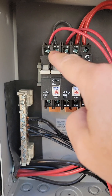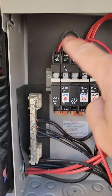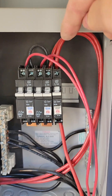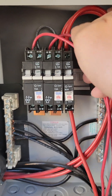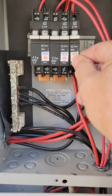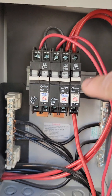I've had situations where these screws were loose and only half the solar panels were working. I've also had it where the screw feeding onto the main line was loose. As you wiggle the cables a little bit you can usually tell if your breaker connection is stiff. Be careful not to over-tighten these nuts in here, because this is just a little plastic circuit breaker.